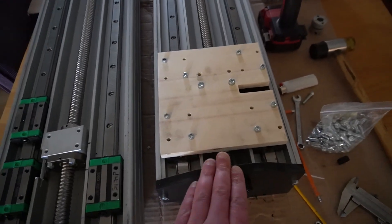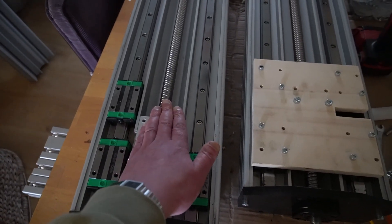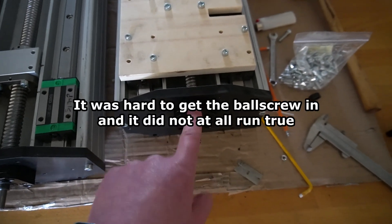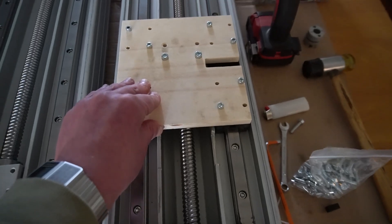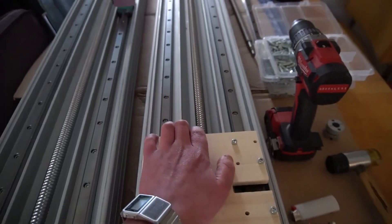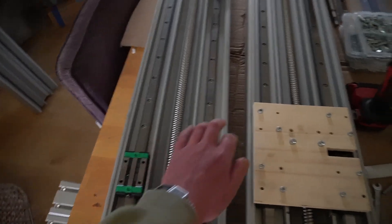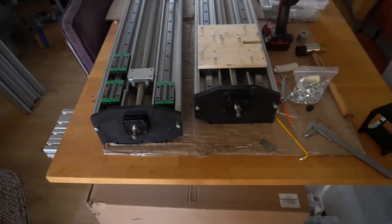I did the second part — there was a video where I tested the ball screw whip and I made the second piece. The thing is, I had a bearing here that was completely fucked, so I threw it in the bin. This one runs a little bit more easily, but I think it has more drag than the first one and also a little bit more whip. So I guess this screw has a little bit more bend in it than the other one. Anyway, what can you do?